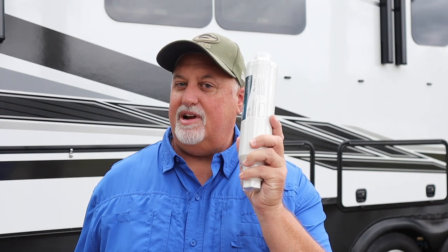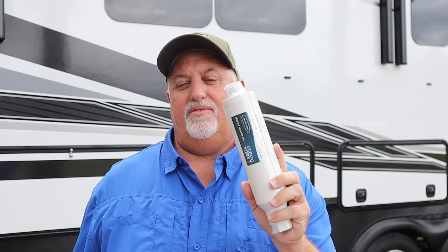After that, you're going to need a filter. This is a 20-micron filter — I highly recommend you get at least this. A 20-micron filter will basically clean out most of the particles that come out of these RV parks. I'll have a link to a previous video where you can get a detailed look at the filter system I put in here with the water softener for good quality drinking water. But when you're just starting out, you can do bottled water or use a Berkey. Either way, you must have a filter. It also helps keep hard water from building up on your pump, faucets, and things like that.